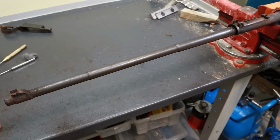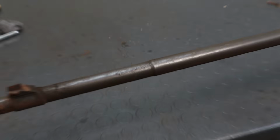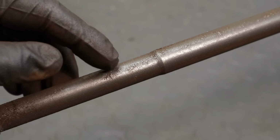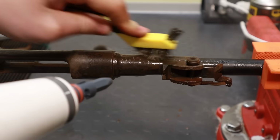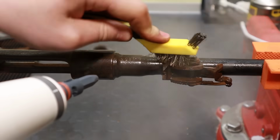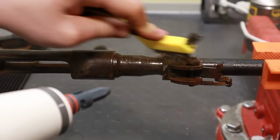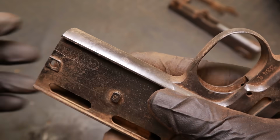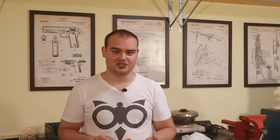First of all, corrosion that happened over many years looks different. Look for these lumps. They are very hard crystals of corrosion products and they take very long to form. This one was on the K98K I restored. Another one where you can clearly see them is the Model 91 Carcano and also the Steyr 1912 that I did last. In order to cause this rusting on purpose, I would have needed to start doing it before I even thought of doing YouTube. So if you see these, the decay was probably genuine.